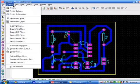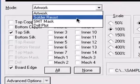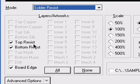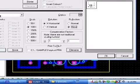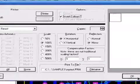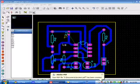And then if you want the green coating that protects the soldering, which is known as the solder resist layer, you'll have to select solder resist from here. Click on the bottom resist. It's a single layer. If it was a double layer, you need the top resist as well. The bottom layer must be mirrored, and also for the solder resist you have to print it in invert color. Once you're done, click on OK.